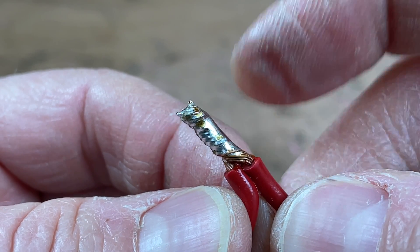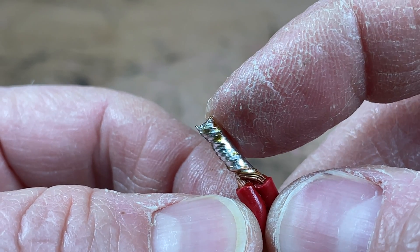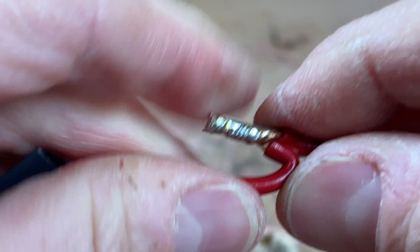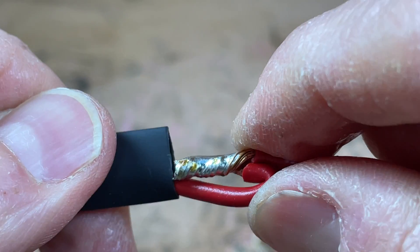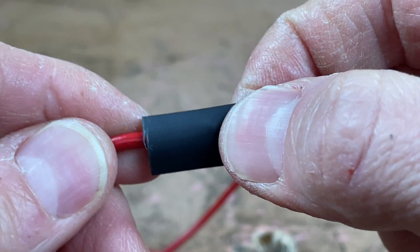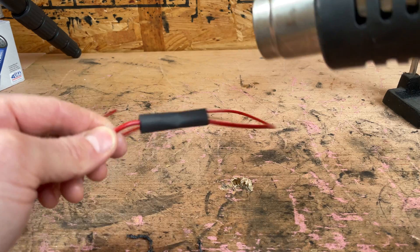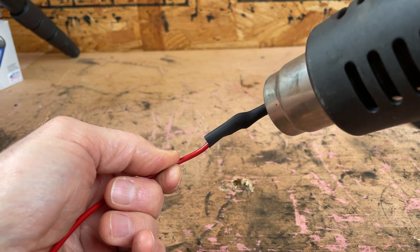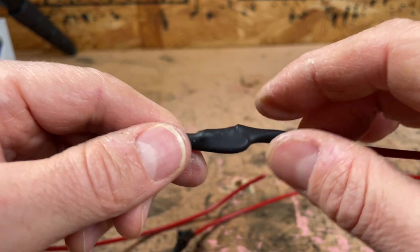This is a very good-looking joint. Not only was that copper wrapped around itself to create a solid connection, but now we have added the solder and this ain't going anywhere for a very, very long time. We need to add some heat shrink — I'll fold this joint together and take my heat shrink and slide it right over that joint, with the bulk of the joint in the middle, covering adequately on both sides. There's that joint: twisted, folded over, and heat shrinked.